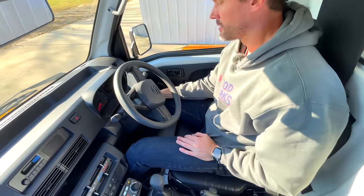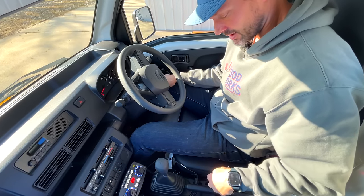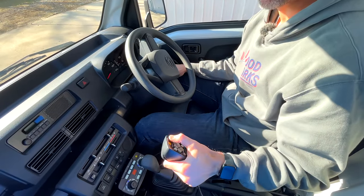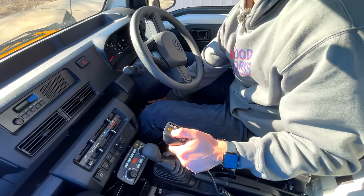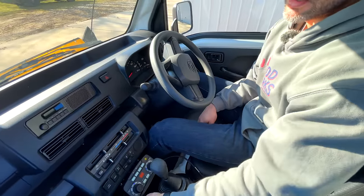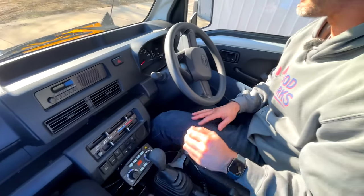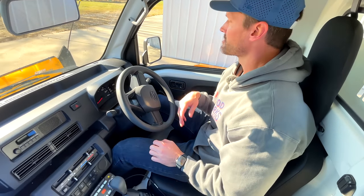The manual is a little different. Fire it up, take the parking brake off — we're in low range, which should be fine. I have the plow on the front so I want to make sure that's raised high enough. What I found when plowing snow is that you could start in second gear if you wanted to — we'll start in first for now.